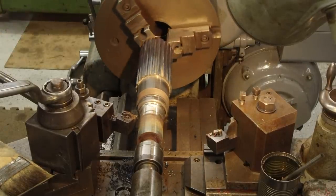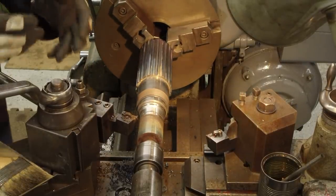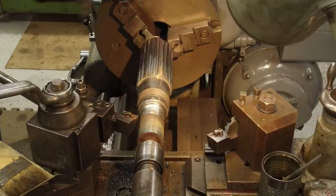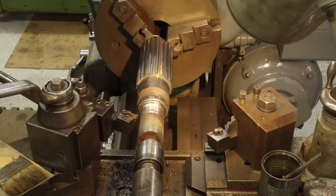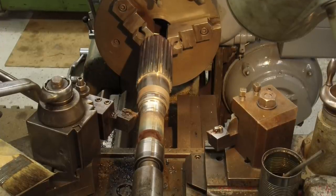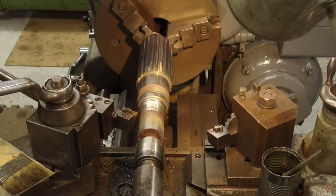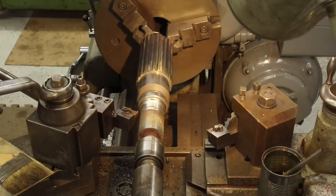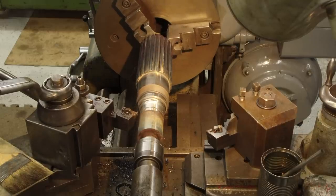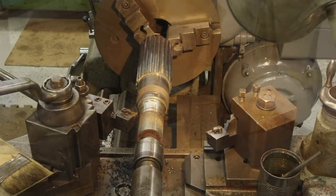Okay, I'm happy with the base metal meeting up with the 11018 rod. And the 11018 rod has given me more strength than if I used any other rod I had. And if we wanted to, I believe we could carburize or case harden the outside of the splines when we're done. We'll give that some thought, and I'll do some research on that.